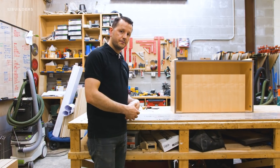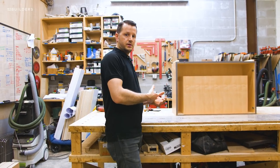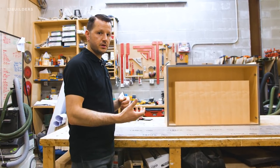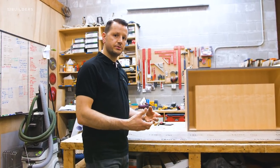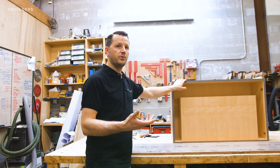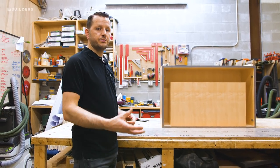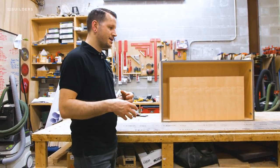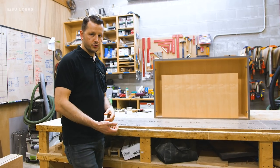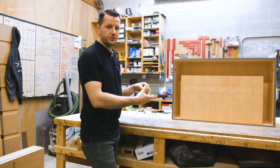What you see in front of me is the hood cabinet — this is going to go directly above our cooktop. This piece here is actually the under-cabinet skin, which is the piece that's going to cover the underside of the cabinet so you don't see any of the raw plywood edges or the color difference in the materials. Since we're going with this gray material, you don't want to see the transition into the bright maple when you look under your cabinets. We wanted to keep the design cohesive throughout the project but didn't want to open that cabinet and see that hood insert staring right back at us. So we covered it up and left as much room as possible so the homeowner can store things like additional spices or extra filters for the hood.